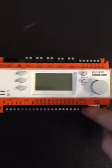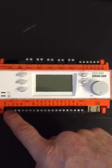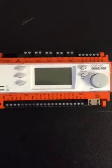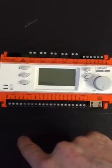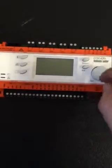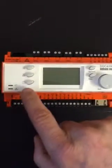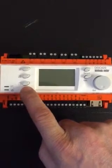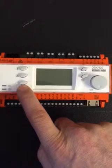That will be the inputs and outputs connected onto the controller and also remote inputs and outputs from the field bus connection or the field bus modules connected on a data connection. Malfunction messages can be viewed by pressing the malfunction message button, and then you can use the select key to acknowledge or delete the message. The third button is a user configurable button, so when we construct the software in PS4000 we can decide what the function of this button will be.